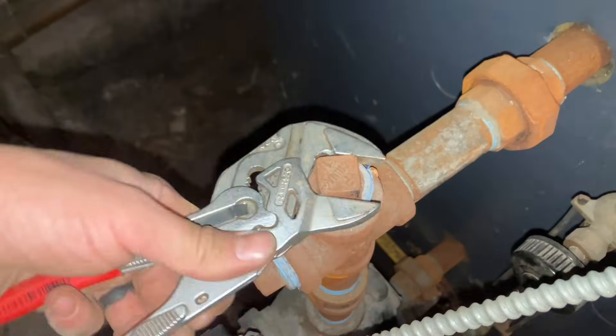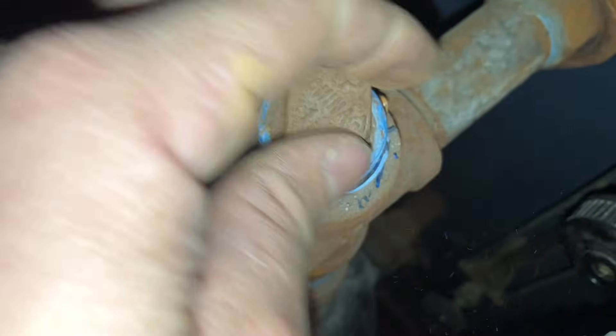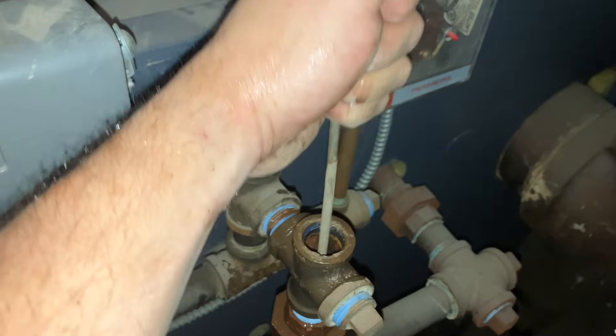Here's what you missed: when I went to restart everything, nothing happened. I checked power across the number 67 and the 51-2, and the 67 was the one with the power problem. So I filled the boiler up — I just bypassed it — filled it up, and took the plugs off the cross tees. I pushed down on them; they were definitely stuck. I loosened them up and was able to flush all the water and mud out.